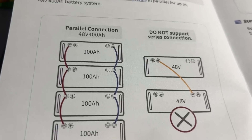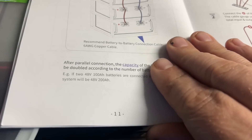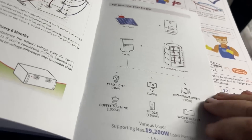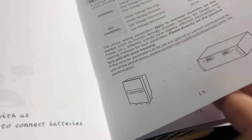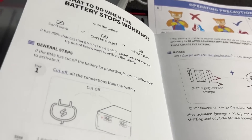It's super easy to daisy chain them together. They don't recommend doubling the voltage on them, so keep them at 48 volts. You pretty much want to follow the manufacturer's instructions when you're spending this much money on a battery. We just have multiple solar panels charging it and it goes right into that inverter. We can run anything off of it in the bus — the 30-amp service on the bus is supplied by that. It's just a matter of how long it'll run off one battery. With 5 kilowatt hours, if your air conditioning pulls 1,000 watts, you could technically run it for 5 hours in a perfect world. Plan on about 4 hours once you account for conversion loss going DC to AC and the inefficiency of your inverter.